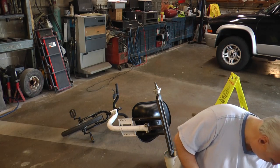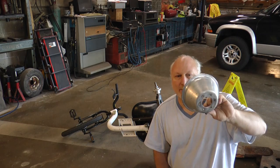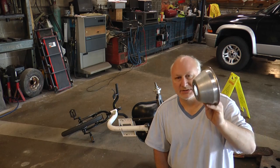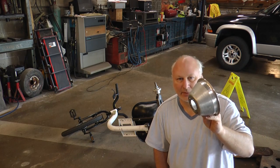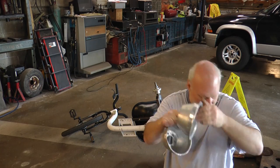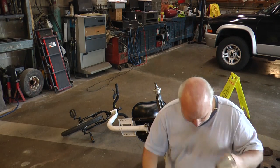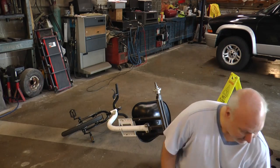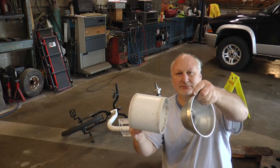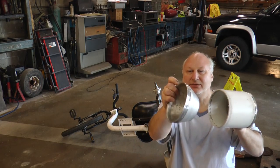Basically all you do is take a rim half — I got them from American Power Sports, but you can find them searching for racing go-kart parts. This is a Van K 3-inch rim half, and I ground down or cut the lip that was the bead for the tire. I did that for all four rims. Then I took the PVC and cut it to five and three quarter inches, so now this edge is ground down or turned on a lathe, and this is cut to five and three quarter inches.